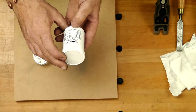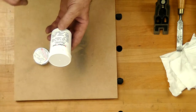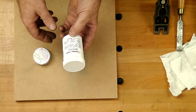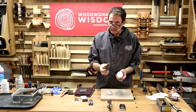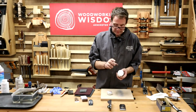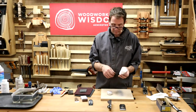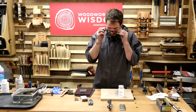Corrosion inhibitor, doesn't contain silicones. That's important. If it contains silicones, when you put your polish onto your workpiece, if you've been using this on your plane and then you planed a bit of wood, that gets onto your timber, you won't get a finish to stick. So whatever you put on cannot contain silicones. All right. Craig, nearly done. Let me just do it. This is a micro crystal type wax, but with basically a rust inhibitor in it. All right. The hand tool wax is very similar.